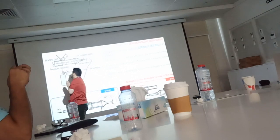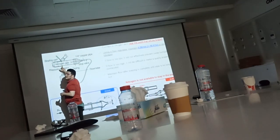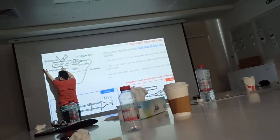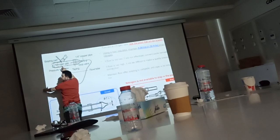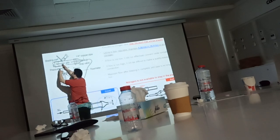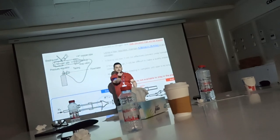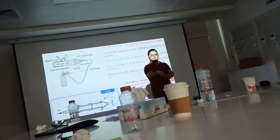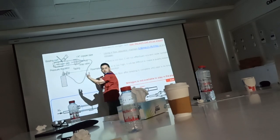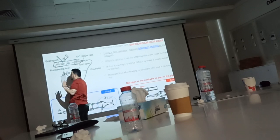After that, where you need to braze, here for example, okay? You need to keep, after the socket, 15 cm minimum. Okay? You cannot braze where the nitrogen is going out. In the same area where the nitrogen is going out, you are making the brazing. So you need to keep a safe distance for the nitrogen to go properly. 15 cm minimum or more. Okay?